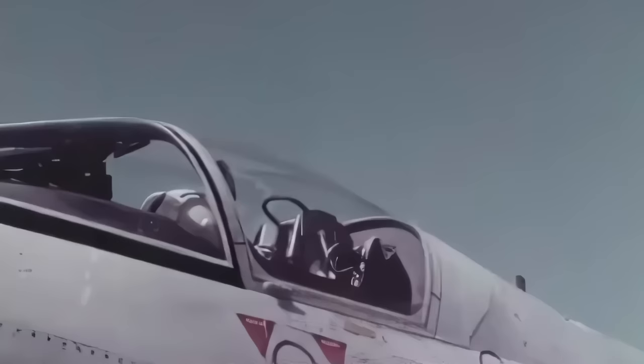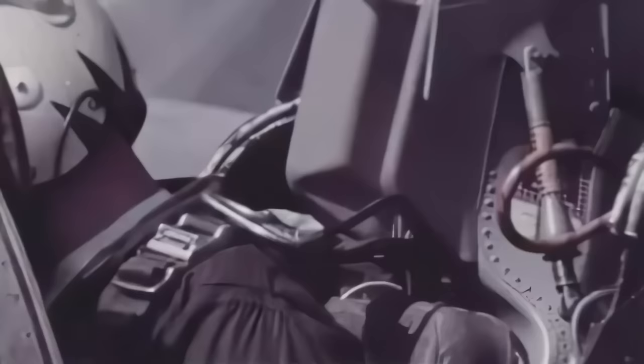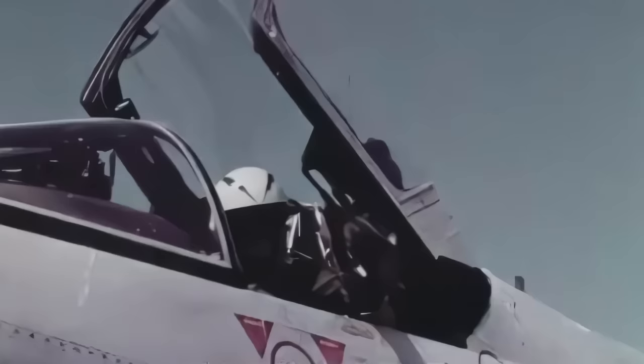If you're the pilot being relieved, do not unstrap until the aircraft is chocked and tied down with three chains. When the aircraft is tied down and the switch pilot is at the aircraft, pull down the head knocker, install the canopy strap, unplug the oxygen mask hose, hand the kneeboard to the plane captain, unstrap, and dismount.